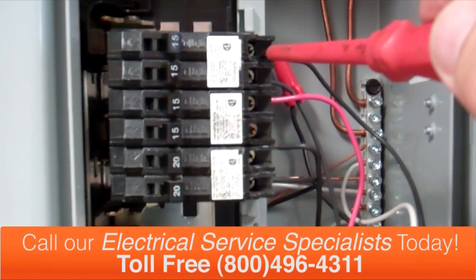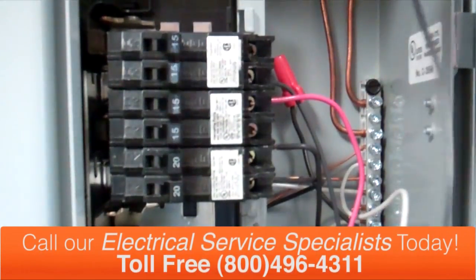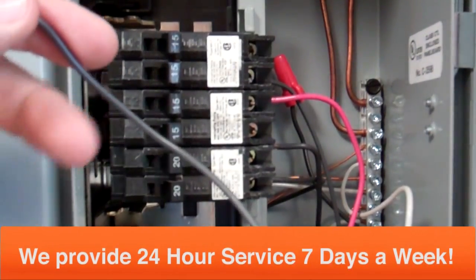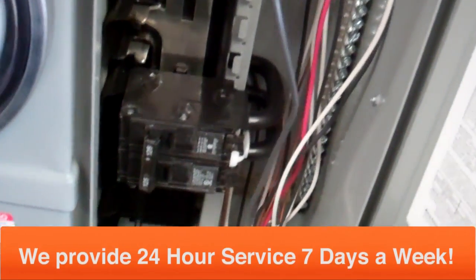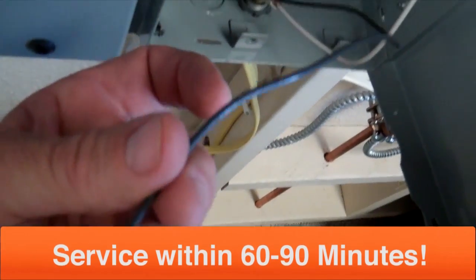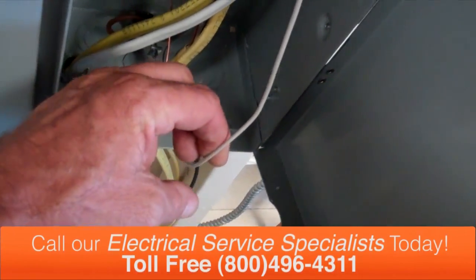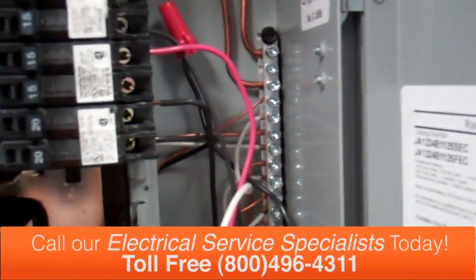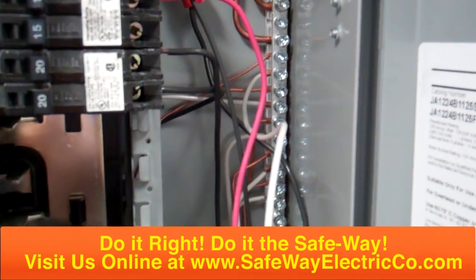This is my lighting circuit right here. I'm going to go ahead and remove the wire from underneath the breaker, because we're going to be installing an arc fault circuit breaker. We need to find the neutral wire for this circuit, so we're going to follow this wire down the panel and locate the sheathing. You want to identify the sheathing where this power wire is coming out of, and then carefully follow the neutral wire all the way up — just like I'm doing here — to prevent any errors. If you make a mistake identifying the neutral wire, your arc fault circuit breaker isn't going to function like it's supposed to.